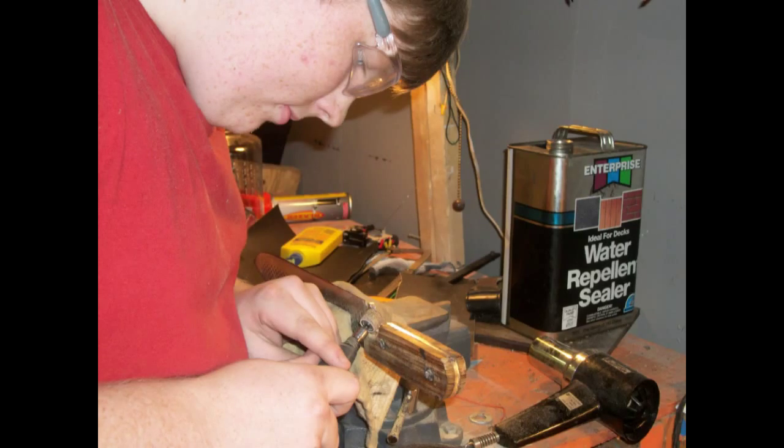So here's a picture of me grinding the handle scale with the Dremel tool, or rather cutting the finger groove and coming in at an angle with that. It's easy to do if you put it in a vise. I tried a file too, like one of the round files, but I think I prefer the Dremel tool. If I set it on a nice low speed, it works better for me. And just overall, it's easy to control.